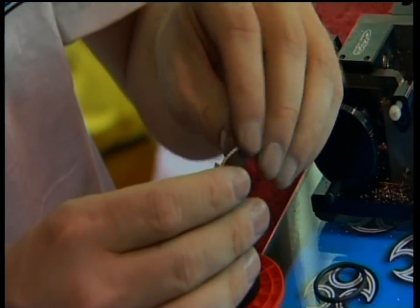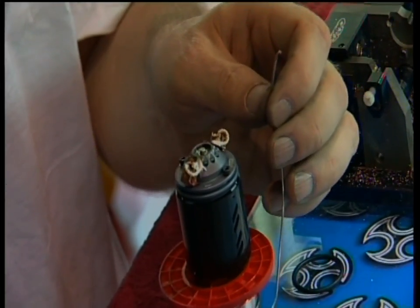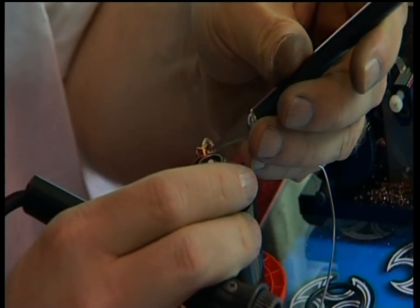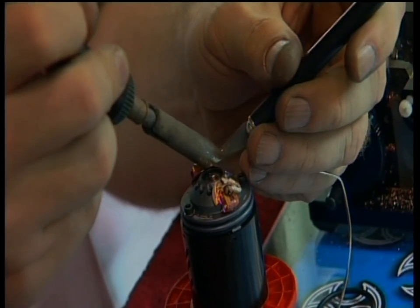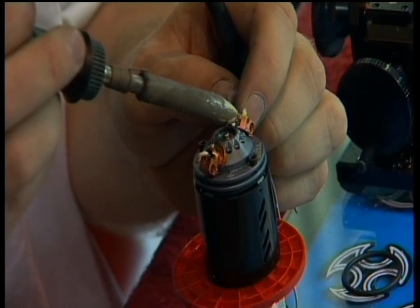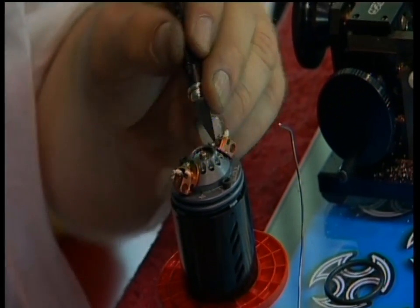You take the solder, put the wire in the correct position, and do it for both sides. I actually advise — in regards to soldering — use a very good tip which is really hot, and take simply a knife. You apply a bit of solder on the motor, take the knife, and hold the wire in position. The knife avoids the solder going into the wire because the heat goes into the tip of the knife. This way, if you are not a professional solderer, you make sure that the brush wire will not get too hard. Do the same for the other position — a little bit of solder on, take the knife, hold with the knife, wait till the solder melts and the job is done.